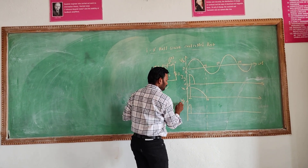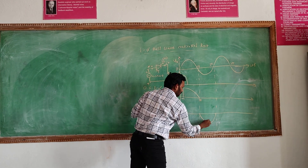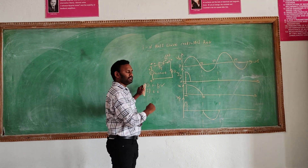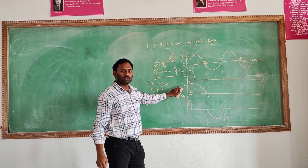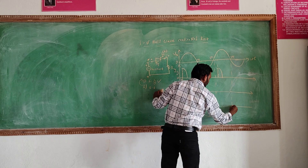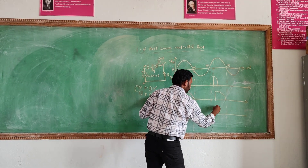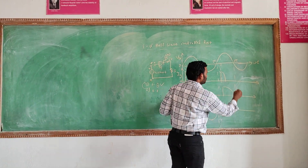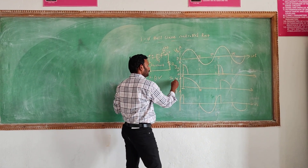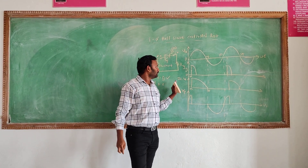The waveform is drawn here. We draw Vt — voltage of the thyristor. The gate pulse and output are shown. Again, positive half cycle comes — anode is positive, cathode is negative — so the similar process is applied. Again we give the gate pulse, and the thyristor conducts from alpha to pi. In the negative half cycle, the thyristor is in off state. Here is the output characteristics and the current characteristics also. With R-load, voltage and current waveforms are the same. That was the topic. Thank you.